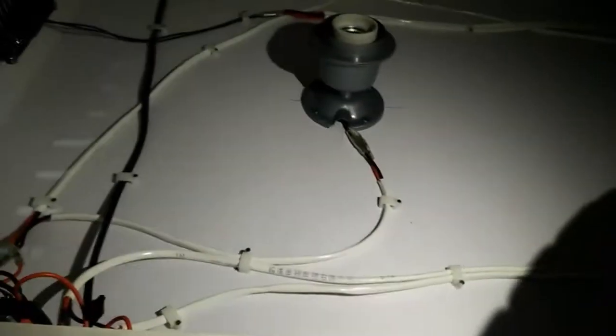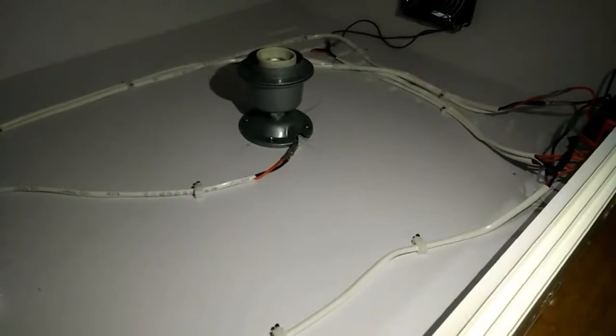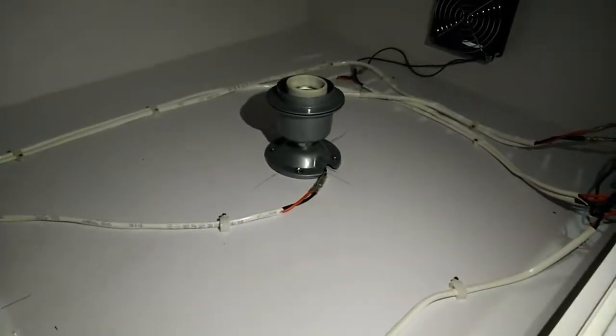Once you've tested the electricals, then you can go ahead with the Brooder still upside down, install these little cable holders, which is a matter of placing them and hitting it with a hammer, which basically holds the cable on the ceiling without falling down everywhere. So just a hammer and just nail it. And bear in mind, keep wires away from the heat source. See how I've actually cleared it. There's no wires running except the one that powers it.